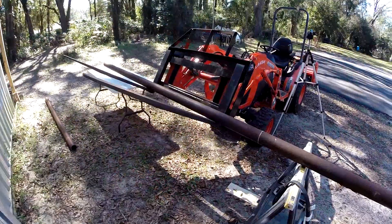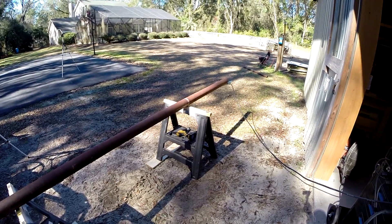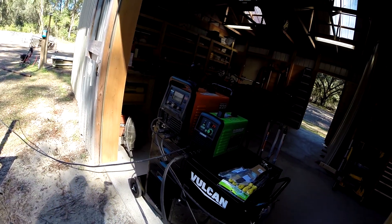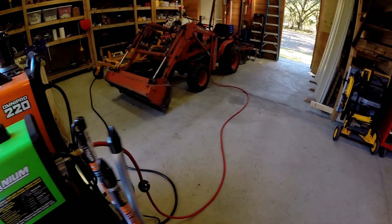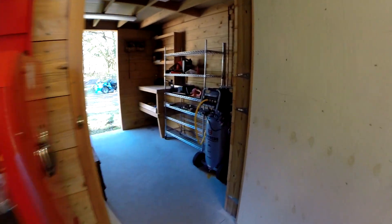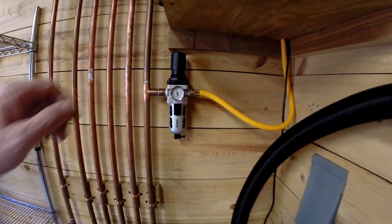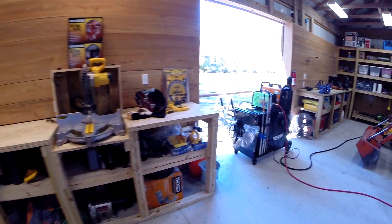Here's the setup: we got a 21-foot long schedule 40 structural steel pipe. I got my ground over there and I'm going to use the plasma torch to cut it on this line, which is roughly in half — this will be a couple of ten-and-a-half footers. The Titanium is at 29 amps, got the air supply here, compressed air at 92 PSI, 200 PSI in the tank, got the dryer and filter regulator. We're all set to go — let's give it a cut.